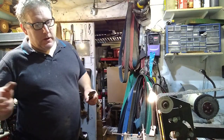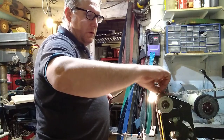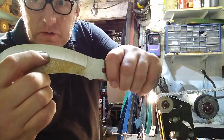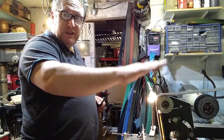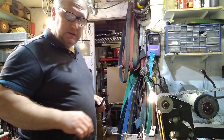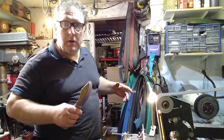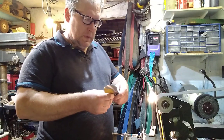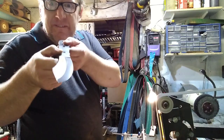Then you go back to the grinder. Now you can go to your 120 again and really tidy up all of this as much as you can on a 120. But then what I do is I go to the cork belts. I go 400, 600, and then 800 — but I'm going backwards, real slow. That speed backwards, which keeps the crisp shoulder flat as you like.